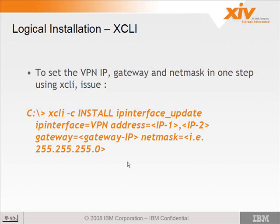On your install bat file, basically you just go in and edit that to what the customer wants and then execute it. It is on the database, so you can get it from there. At the top of the file, you'll set the parameters, like the management IP addresses, the gateways, the net mask, and all that you want to use, and then execute the bat file, and it'll use those values to execute the commands lower in the bat file.